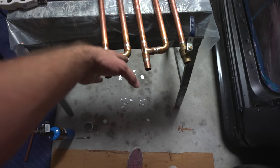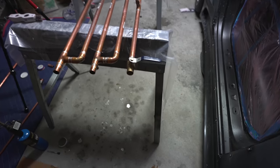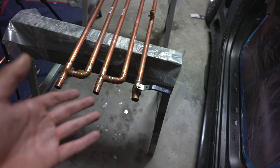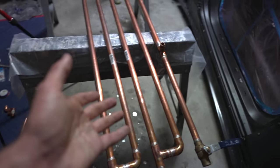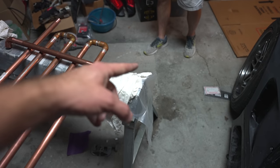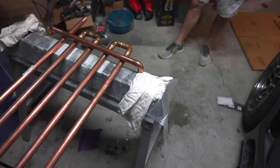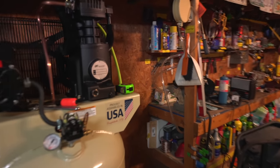We didn't solder in the ball valves on these two legs yet, but the idea is that periodically to get this moisture to escape you just crack the ball valve real quick — at least you have drier air than before. Every 10 minutes or so you just crack them open to bleed out all the moisture. The last leg comes up and around to an outlet leading to our tertiary form of reducing moisture through a desiccant system, and all of this will be conveniently mounted on the back side of the wall here.